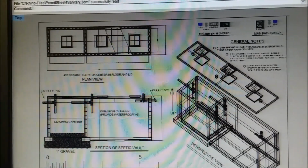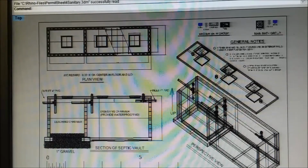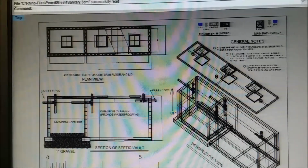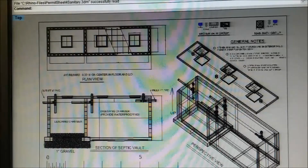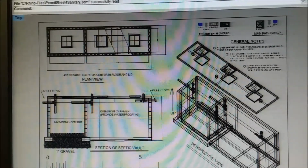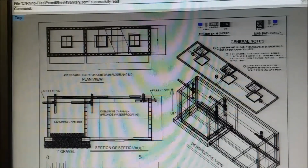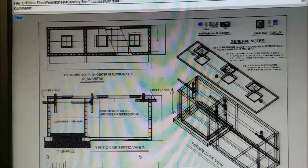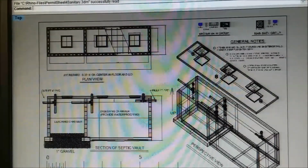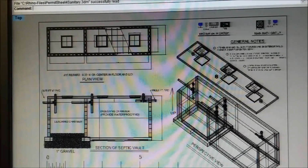It's got a dimension on it like 9 inches, but you can't read it because it's too small. That's airspace. So everything is referenced to the surface level of the water. Where your sanitary stuff comes in, it can't be underwater. Otherwise, it'll back pressure the flow coming out, slow it down, and then your 1/4 inch to the foot grade, that's 1 in 48. 1 part in 48. I don't care if you're talking meters, centimeters, inches, thousandths of an inch.